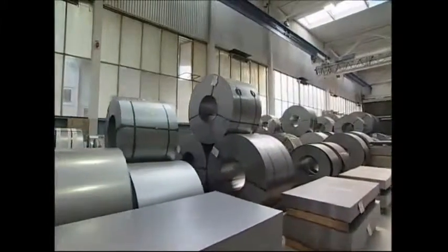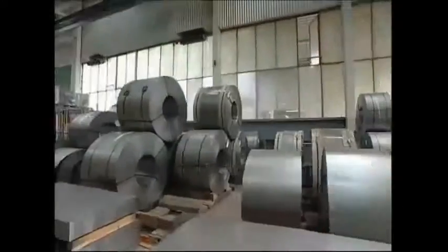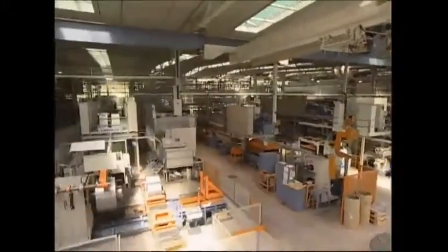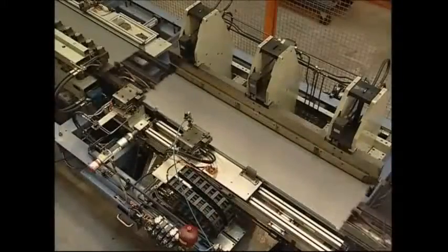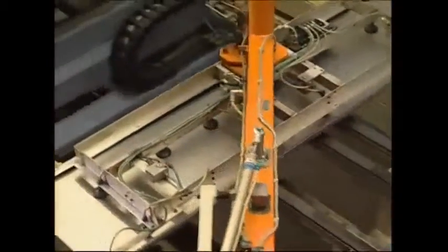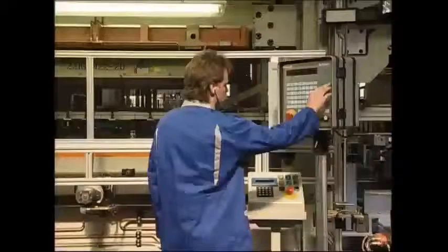To build these handy cabinets that we take for granted, you need steel. It's used to make most fridge exteriors, which are fabricated at a factory like this one. A 160-ton press stamps the individual parts out of a steel roll. The process has 36 different steps and is watched by a vigilant quality control manager.